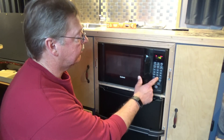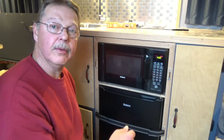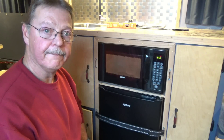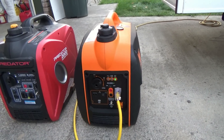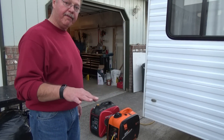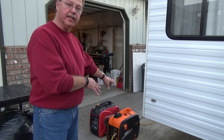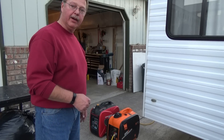We're going to put the water in for four minutes — we want that water to boil. As soon as I hit start we should hear that generator rev up. Just as I thought, the generator did kick up. Right now I think it's running at about 50% load; we're only pulling about 7.5 amps. At 850 watts on a 1600 continuous watt generator, it's running pretty smooth and runs the microwave just fine.